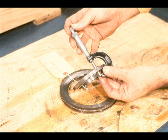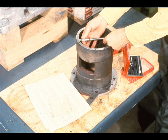Normally, the bearing spacers will not be worn or damaged; however, they could possibly be damaged during disassembly. If they are, repair or replace them. Mike all bearing fits in the cartridges and compare your measurements to the specifications set forth by the manufacturer.